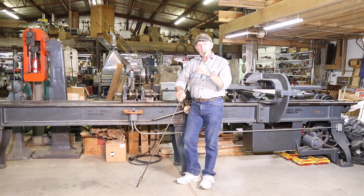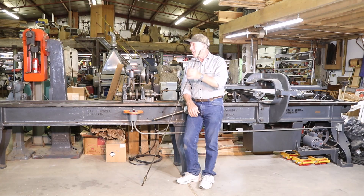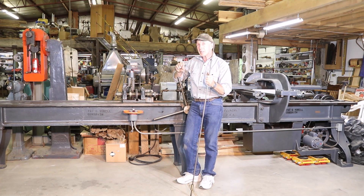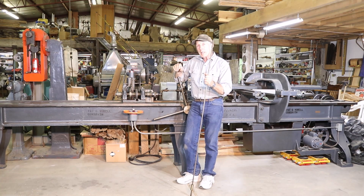This is one of the rifling cutters here, and this particular one is a .50 caliber — I'll let you use your imagination as to what they might have been rifling during the First World War with a .50 caliber cutter. This one's been modified a little bit from when it was put into use back in the 1890s, in that it's now capable of both deep hole drilling and reaming that hole before rifling, which is a tremendous advantage. That's something that Pat Vowell — a very ingenious old-time gunsmith — set up so that all those functions can be done on one single machine.